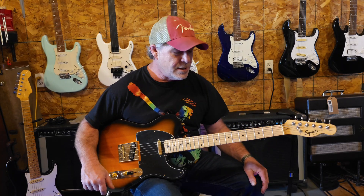So the cap was bad — after I removed it and tested it, it was no good. I changed the cap as you saw, tried it again, and I could tell the cap was functioning correctly, but the potentiometer was also bad on the tone control. Everything looked like new in there and the guitar didn't look like it had been played at all, but somebody had been in there modding things. It probably got really hot and had been soldered a bunch of times. In hindsight I should have just changed it when I changed the cap.